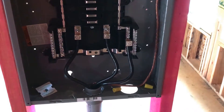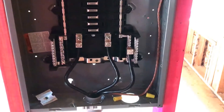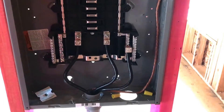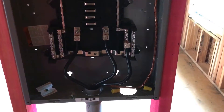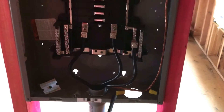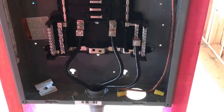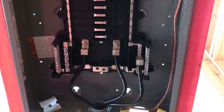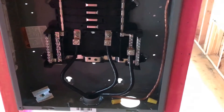One done. It's not anything special, but it's my first time ever wiring up a main breaker box. I've swapped out breakers and wired up downstream receptacles, but it's nothing different — just hooking up bigger wires. So you can see we've got two primary leads coming in here that'll carry our two 120 volts, so this box will be able to carry 240 because it'll power the electric dryer, the electric stove, and then of course just the one neutral and the one ground.